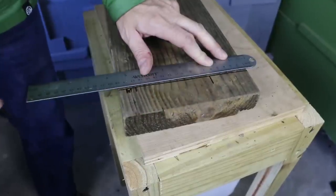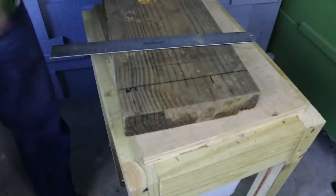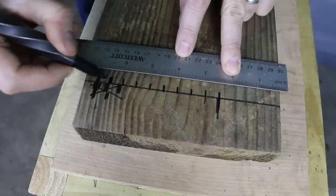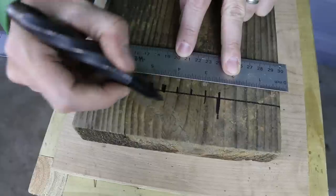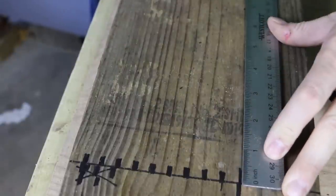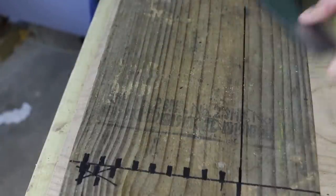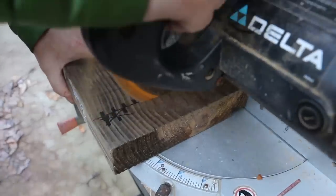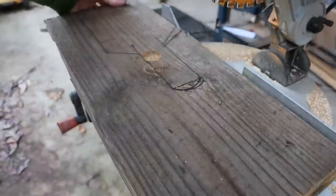I'm cutting a couple of inches off the end of the board to avoid a large knot. I'm marking at half-inch intervals from the last tine, and then I widen each mark to accommodate the width of the trimmer line. I'll extend the width line 7 inches to set the length of the fork, and then a depth line at 6 inches where I'll stop the table saw cut. I rough out a handle to determine the final length, then cut to length before heading to the table saw.